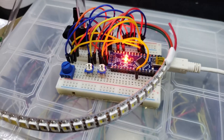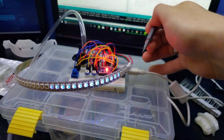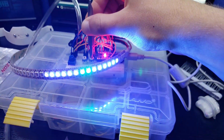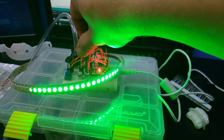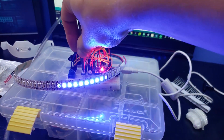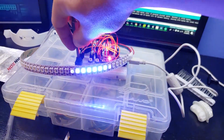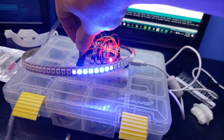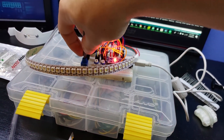A little update: got those sensors in place, updated a bunch of stuff in the code. The breath still works. I've got some potentiometers in there temporarily for the other controls — the roll dimension activates the overlapping bar, and the pitch dimension changes all of the colors. For each animation there's an A and B, and the pitch fades between them. There's also a potentiometer for the bite dimension that triggers flashing LEDs. I think this algorithm is about as good as I'm going to get it.